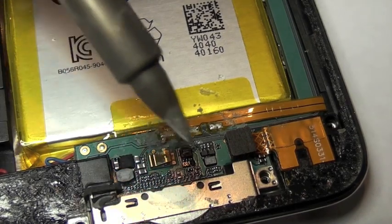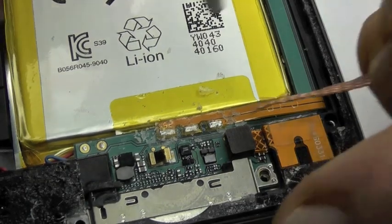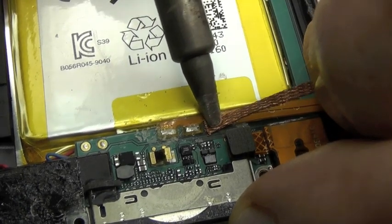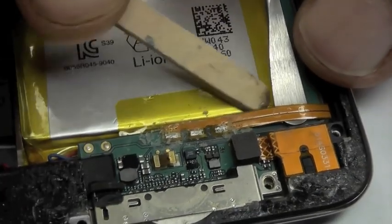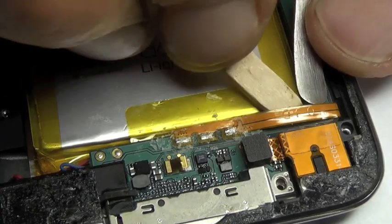I'm using quite a wide tip — it's nice and clean. So a little bit of desolder braid. I'm only going to be disconnecting one of these terminals here, but the same procedure applies if you're going to remove the whole battery. Just need to pry it up slightly, put a coffee stirrer under it to give it a little bit of pressure for lifting it up.